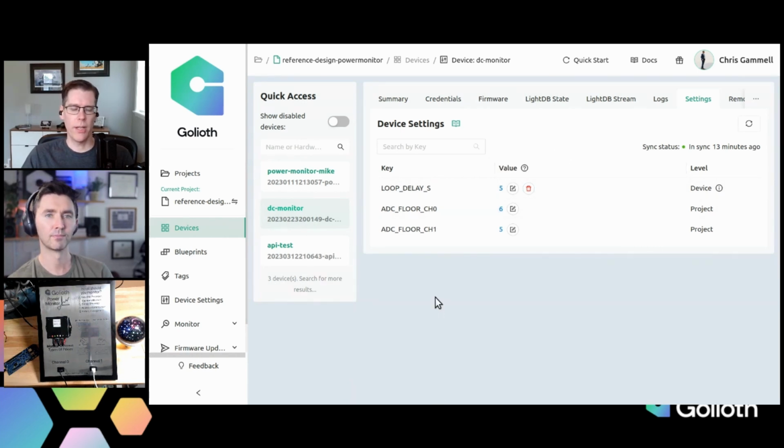I've just put a raw reading here because some transient electromagnetic waves can sometimes register a 0.01 milliamp reading on these chips. So I put the floor in there so that it would read 0 when it's actually 0. But if you have a high load, low load sort of application, you really only want to know when it goes into overdrive on this device.